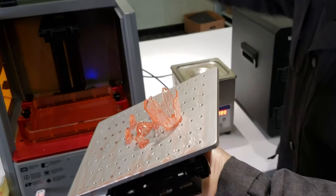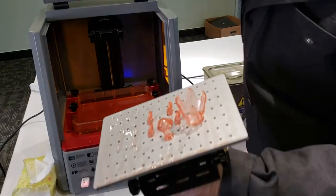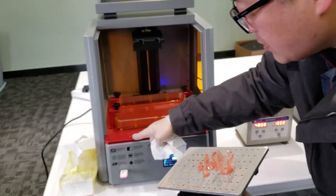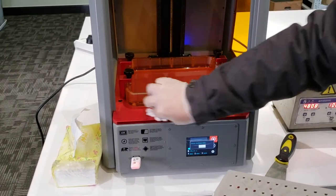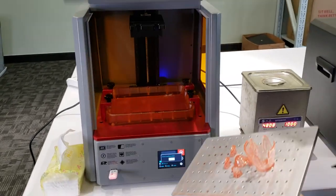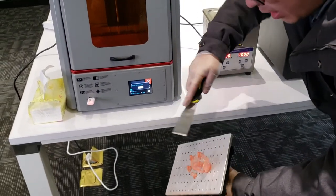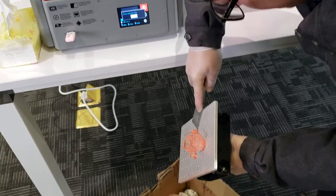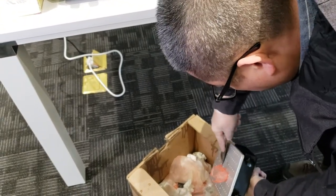Each of the prints is very detailed from the CGR 4K printer. When you take them off, you need to close the door. You'll see we have some resin on the surface of your printer — you need to clean it immediately so you won't ruin your printer. Then use your scraper to take them off.